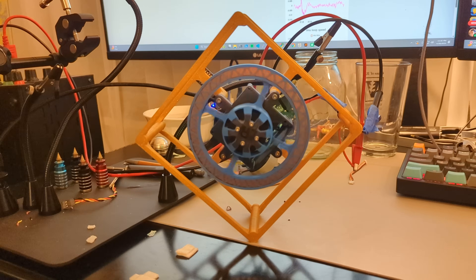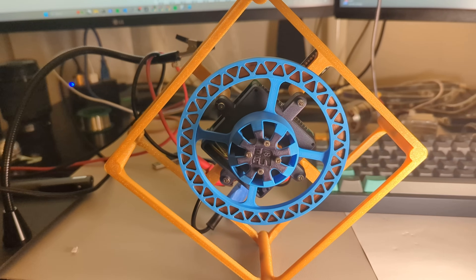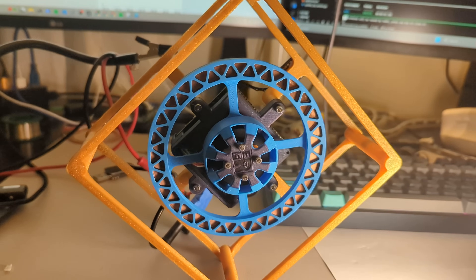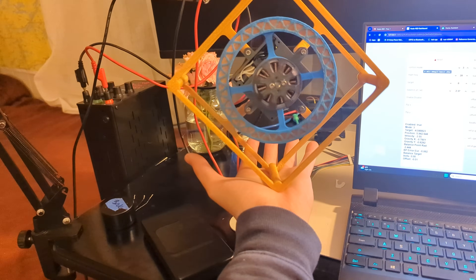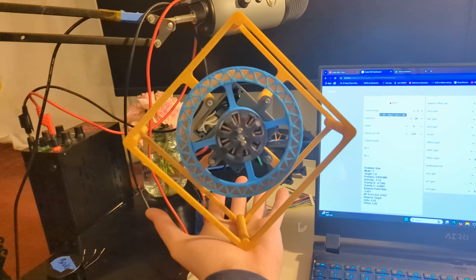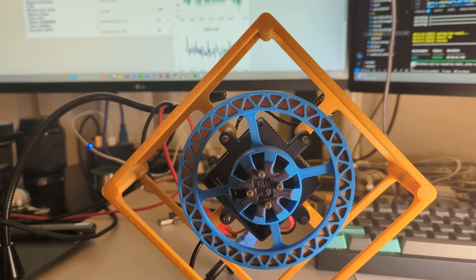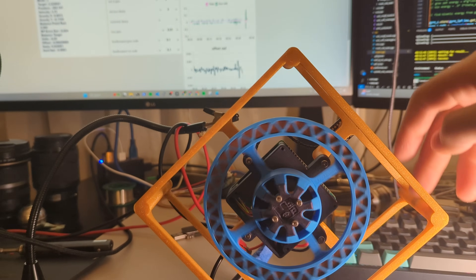We finally did it. It doesn't even look like it's moving — that's mesmerizing. With a little bit better lighting so you can see it. This one is using a gimbal motor and gimbal motors are really good at slow speeds, so this one's very stable. I can switch this out for a drone motor, which lets us have bigger disturbances like holding it in my hand. And here's a demo showing what happens if you build up a bunch of speed — the second PID loop will slowly kill that speed from the reaction.